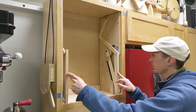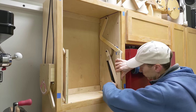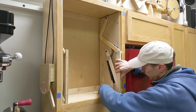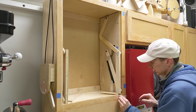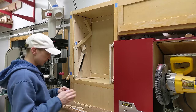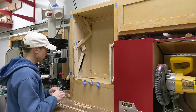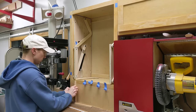These two arms are what's going to attach to the cabinet door, and I'm going to space them out with some wedges. That will make sure they're sticking out past the face frame of the cabinet so I can line up the cabinet door to them. After messing with some shim pieces, this arm is sticking out just past the face frame. To help position the cabinet door, I cut two spacers and I'm going to tape these to the underside of the cabinet, and that will give me a reference point so that I can hang the door at the correct height.